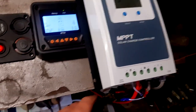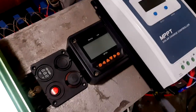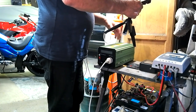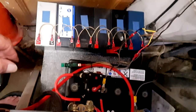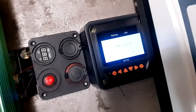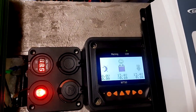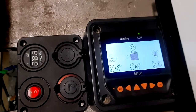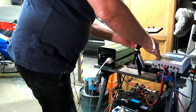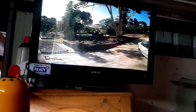To switch batteries or to switch systems, all I need to do is flick on my 100-amp switch and that'll switch over to the large batteries — so that's working exactly as it should. If I turn that off as well, with both switches in the off position my system is not registering batteries. What's showing is just the power from the sun running the controller and the display box. To turn everything back on properly I need to turn off the solar first — this is all a bit rough but it's going to be put into a cabinet and properly wired up. Now I have nothing functioning at all.